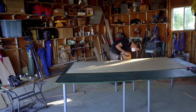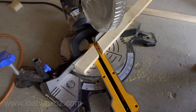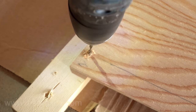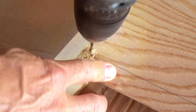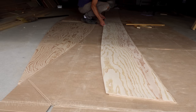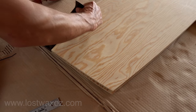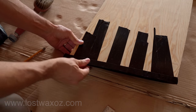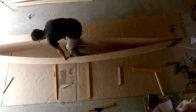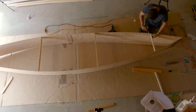When I was finally back to where I left off I looked like this. I cut four temporary spreaders according to the pattern, drilled some holes six millimeters in from the front along the line so I'd be able to zip tie the ends together. I lay the two sides together lining them up inside to inside and dusted off all the dust so my duct tape would stick. I used a bunch of strips of duct tape to tape the ends together and put a zip tie through the hole to reinforce the tape so it wouldn't pop apart. I loosely screwed the spreaders in their proper places and then got some help to flip the canoe.